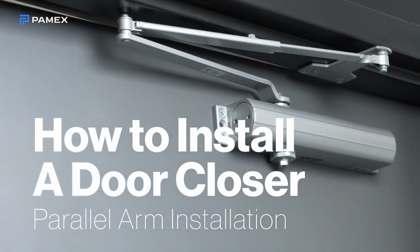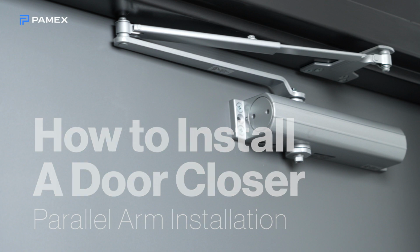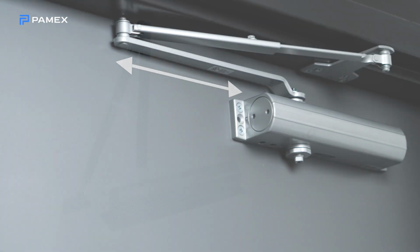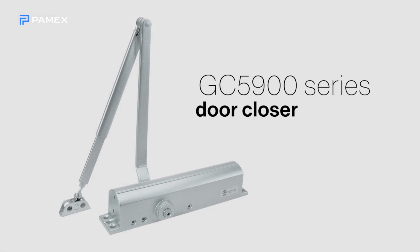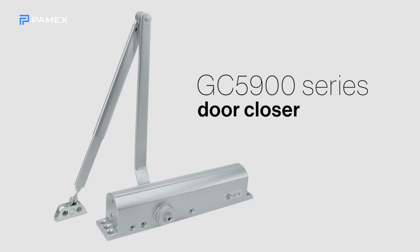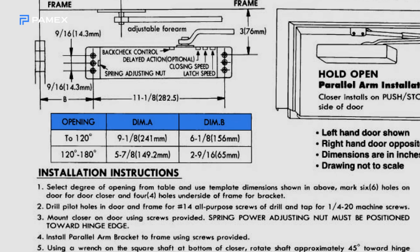How to install a door closer using a parallel arm installation, where the closer mounts to the push side of the door, with the arm parallel to the door. We're installing Pamex's GC5900 series door closer. For others, refer to their installation instructions and templates. Select the degree of opening from the table provided to get the right placement.